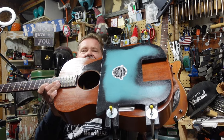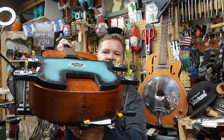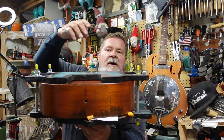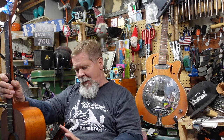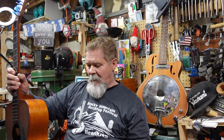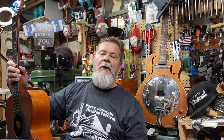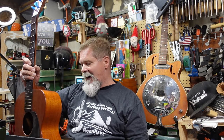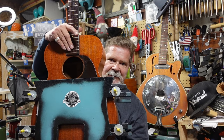This is Fred's flat press. You see these guitars have a hole right here. And you see the neck removal jig has a place where the neck fits here. It's turned around here. So I thought, if I'm going to make a flat press, maybe I should make it to where it's also a neck removal jig. Now, I want you to remember, you cannot put it on an arch top because it's not meant for arch tops. You will crush the arch top. The only redeeming thing about an arch top is the arch. Think that one out.